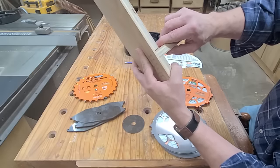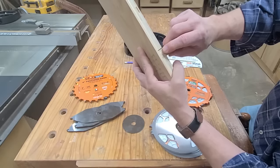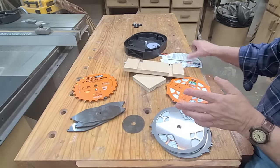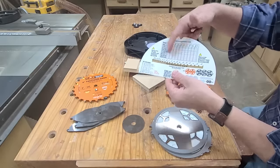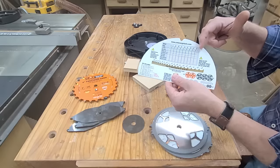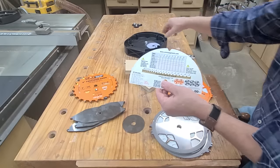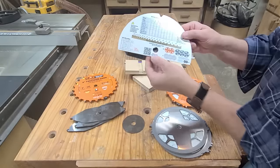The CMT blade has the same little bat ears, but they're so tiny you can barely see them — glue would easily fill that gap. The set comes with a chart so you can set up whatever width you need, from 15/64 all the way up to 13/16. It tells you which outside blades, which chippers you need, and which locked shim you need. There's also another pack of shims so you can make whatever thickness dado you need.